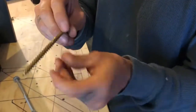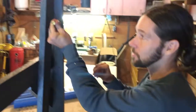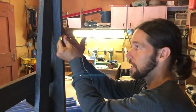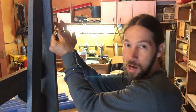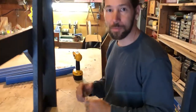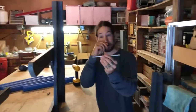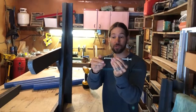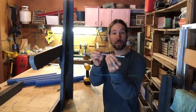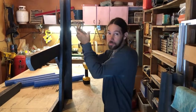And with a cordless drill and the right bit, you don't have to pre-drill. You can just power that sucker straight through into a stud, plywood, solid wood walls, upright post. 2 of those. Works great. So again, pick the right fastener for your application. I wanted to show you this too. This is basically like a lag bolt that goes straight through. You may have a 4x4 post and you want to go straight through, tighten it on the other side. That works well.